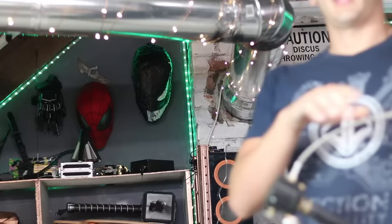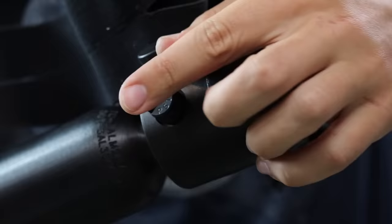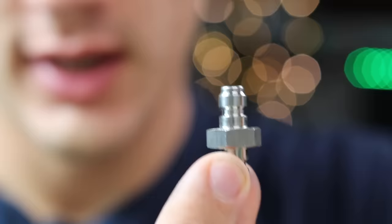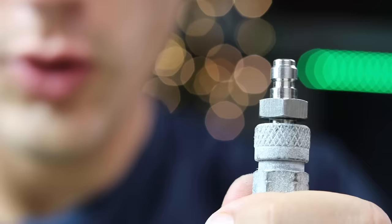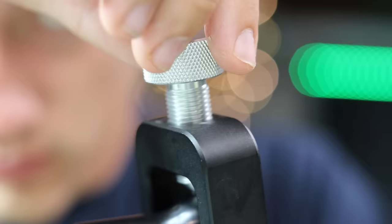We need to figure out how to fill this up. I don't have any local dive shops around, nor do I want to walk in wearing this. Here's how we fill it at home: first, a super high-pressure hand pump that goes up to 3,000 PSI — the amount we need for any substantial bottom time with this small tank. We have three adapters: one connects to the pump's quick release valve, one is the scuba tank adapter, and the last connects from the scuba to the mini portable tank.